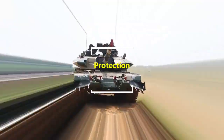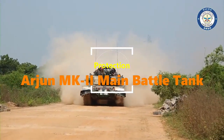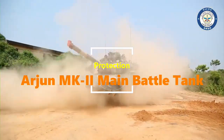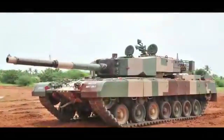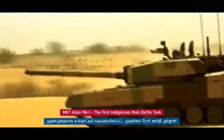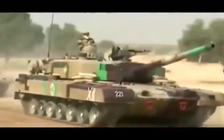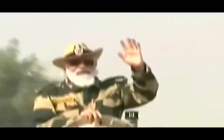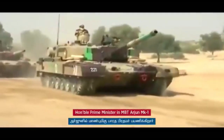In terms of protection, the hull and turret of the Arjun Mk II will have a new design and are fitted with ERA explosive reactive armor, which appears to be designed based on Russian CONTACT-5 technology as mounted on T-90s and other Russian main battle tanks. It is also protected by the indigenously designed Kanchan composite armor, consisting of ceramic tiles and composite panels sandwiched between rolled homogeneous armor plates, tested against a variety of modern anti-tank munitions including APFSDS.